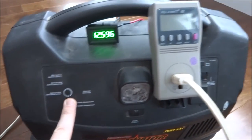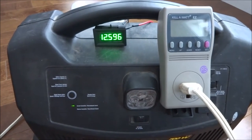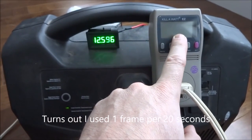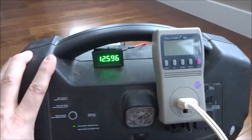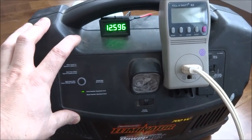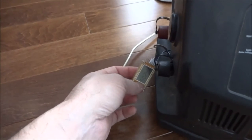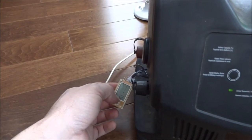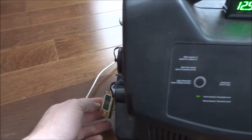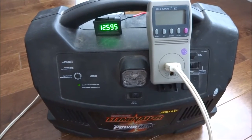I want to set up the rig using a time-lapse camera because this will probably go on for about three hours, which would make for a very long and boring video. I'll take a frame every minute so we can watch the voltage dropping and track how many watt-hours we take from the battery. At a certain point there's an internal alarm that triggers around 10.5 volts — it's quite annoying but we'll let it run until it shuts off. I also have an alarm that will ring if one of the cells goes below 3 volts, just in case a cell bank is weaker than the others.